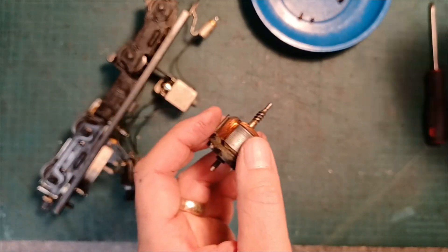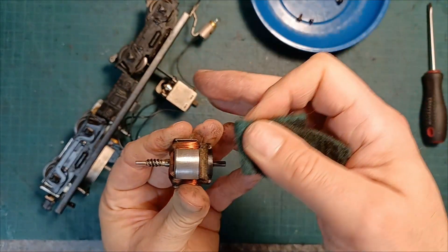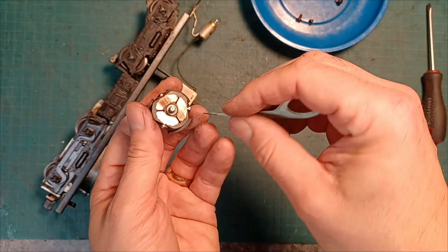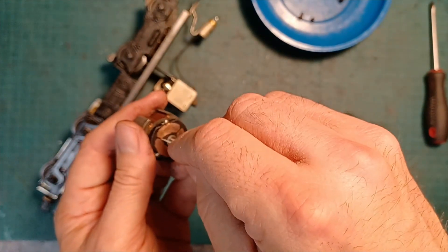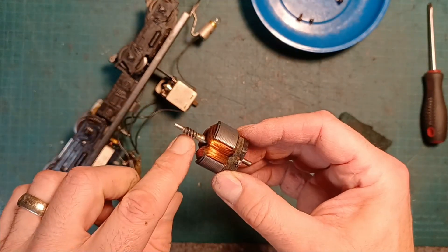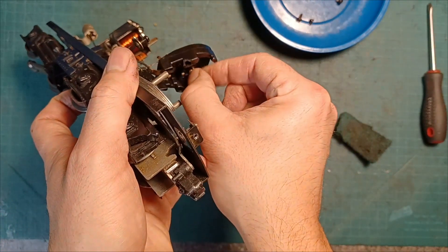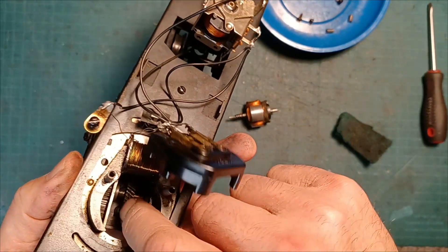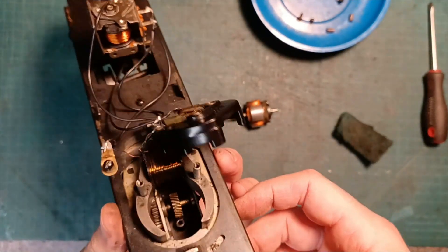We're just going to get a little bit of the surface rust off, polish those up a little bit. It's looking good already. With my little toothpick tool, I'm going to drag it through these slots to make sure they are clean and clear. Right away what I'm noticing when I took this motor out is there's no grease on this at all. I'm looking down in here — there are our brushes. I'll pull those out so I don't lose them. This is pretty bone dry in here.